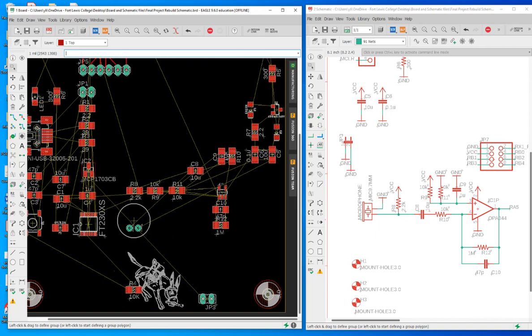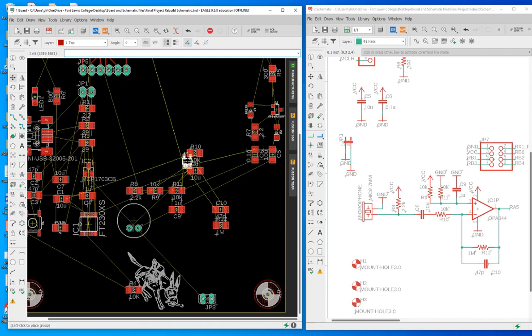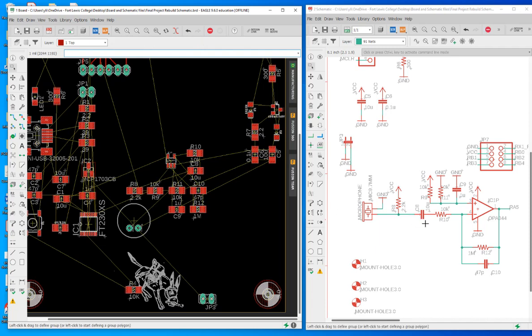C9, R10, C9. Okay, this is making a really nice connection. R10, this guy. Okay, let's do this. And it's having a direct connection to the operational amplifier, so I just place it like this. So you can see at least these are very straightforward connections to make the routing easier. And you need a R12 here. Okay, direct connection, so we don't want to change too much of it, just directly place them next to each other. And I think that's everything here.